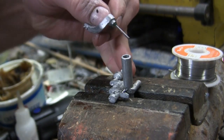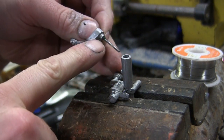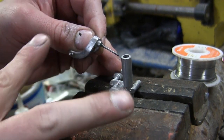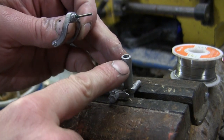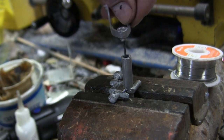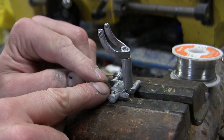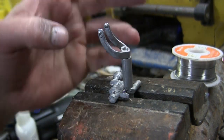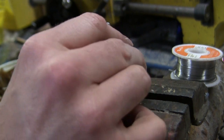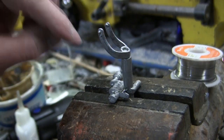Now, in case anyone's wondering, John, can you make this piece function where it can pivot? The answer is actually yes. It's not too hard to do. You just, instead of using this rod here, use a bolt, like an M3 by 20 millimeter fastener of one flavor or another. You then drill and tap this out on the inside. So when you secure the bolt, you can then have the piece lock in place and the yoke can freely rotate. However, because of the travel lock system that this thing has, you can't really do that with the unit built out of the box and would require a little bit more modifications, and that's really out of the scope of this video.